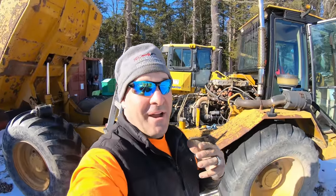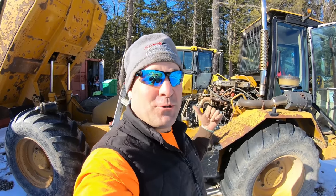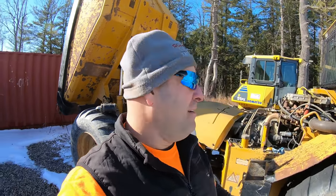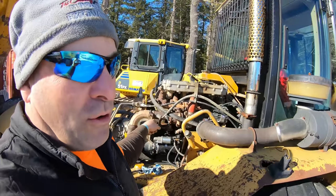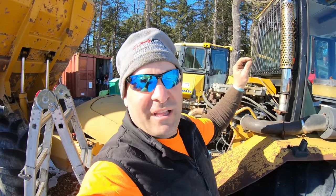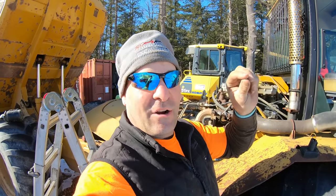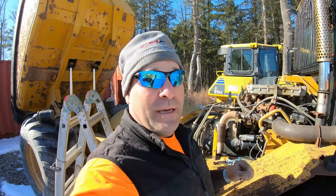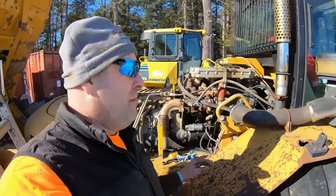Well, it's fired up, but you heard that clicking on the third time. It's still clicking, so that other starter's good. Oh, wow. So the next place I'm gonna trace is in that alternator where those wires go up, because that's the only spot I haven't looked. And because those wires smoked, I was feeling them, and where it connects into the alternator, it is almost like the eyelets around the alternator are kind of rope. It's something loose somewhere. I thought for sure it was this in the starter right here. Needless to say, I got a brand new starter in it. I got a spare starter, so we'll go from there.